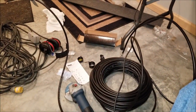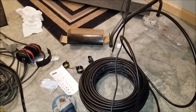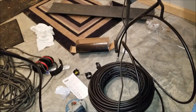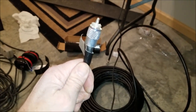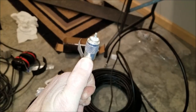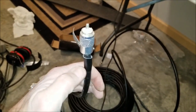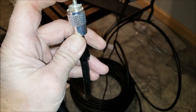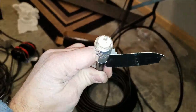This was one of the main culprits that started me off in reverse today. This is LMR-400, and I ordered it with fittings. I assumed they were two-meter fittings — which is just a shame. I had to cut the fittings off and put on some PL-259s. If you've ever done this, you know exactly what I'm talking about — PL-259s do not fit well on LMR-400, not even remotely. But my friend Tom told me he's done it many times, so I did it and I think I was successful. This took probably at least an hour or two right off the bat, so I couldn't even get started. Frustrating project, but I'm going to keep at it.